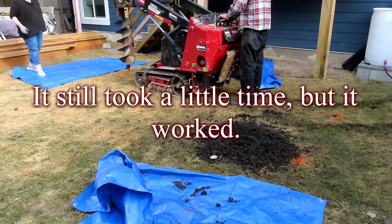Hold the first of the 3 layers of the beam against the blocks and screw it to the floor joists. Add the next 2 layers of beams, one at a time, applying PL400 on the insides of them first. Wedge temporary supports under the beam. Now you can install some more floor joists.